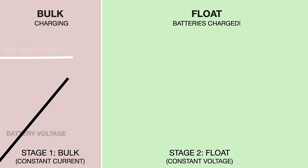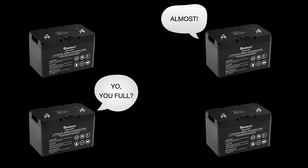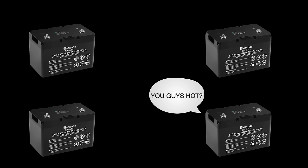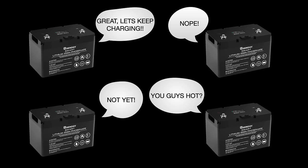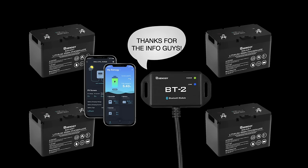On top of that, we can charge lithium batteries extremely quickly — up to about 200 amps per hour — so we don't need to do any of that triple-stage charging anymore. With the built-in BMS, the batteries all talk to each other to safely charge and discharge while monitoring temperatures of each cell, giving real-time overall monitoring rather than the guesswork we had with lead acid and AGM batteries.